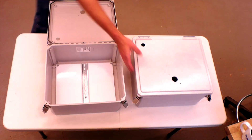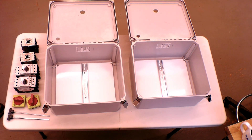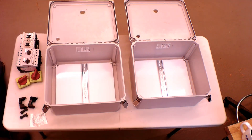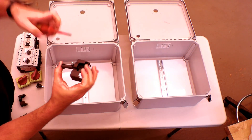This is one of our standard panels. We drill the enclosures in batches of 10 or 20 so we can pull them out and quickly turn them around when you order. Unlike our custom control panels where we wait until the end to measure and cut our shafts, we have the exact measurements and position of these down, so we do that first.